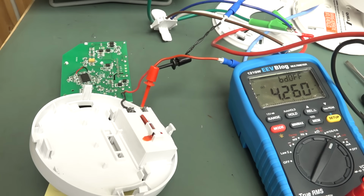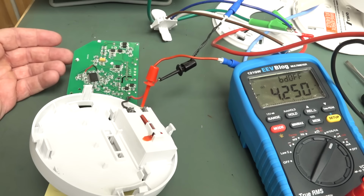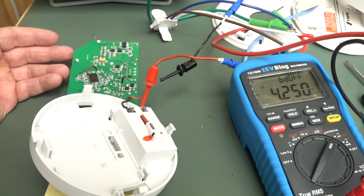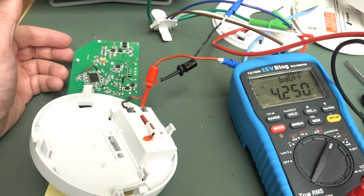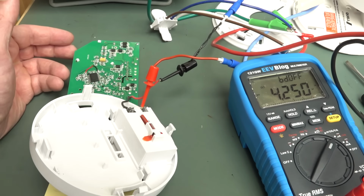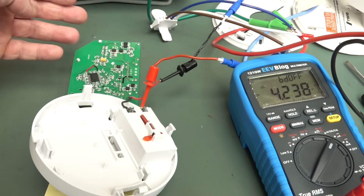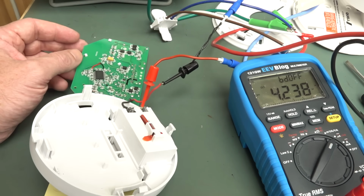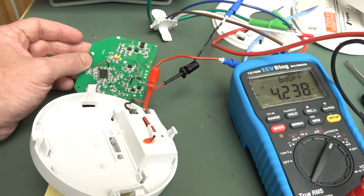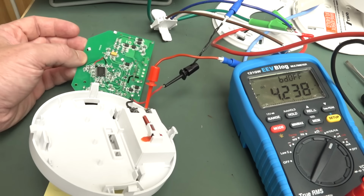And yeah, I can understand that might be significant, but if you explain to people, hey, look, our one is going to save you money because there's no quiescent current in there. You could turn this into a marketing opportunity. You can say, hey, look, our one only draws like 100 microamps, for example, or a couple of hundred microamps, like sub 1 milliamp. If you just spent $1 or $2 more in the design of this thing, and you put some thought in, you could own the market because yours has lower power consumption.